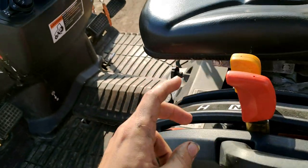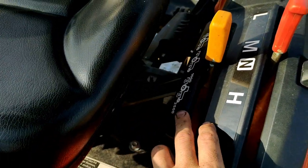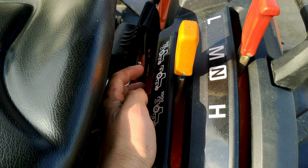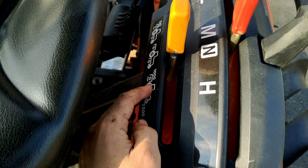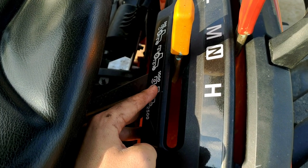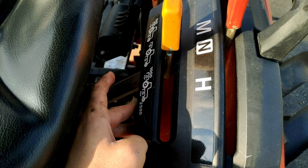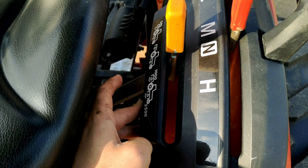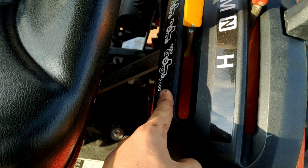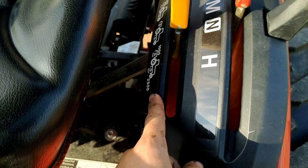And then this particular tractor, I don't think the others have this, a two-speed PTO. So there's the 540 RPM at the rear, which is what you'd expect, neutral, and then 1,000 RPM at the rear. This is quite handy if you run, say, a direct drive wood chipper. They run a lot better at 1,000. A few other things run at 1,000 RPM. And then also the mid PTO, 2,500 RPM, which I believe is similar or the same as the other two tractors.